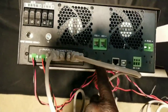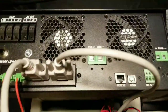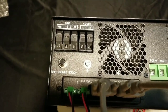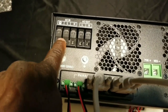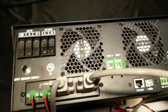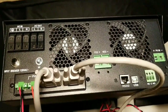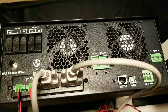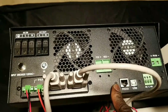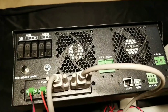Here is the battery terminal — it's recommended to use a four-gauge wire. Right there is positive, negative. Right there is the AC input from the grid — here you can give it the capability to charge your batteries. This PIP cannot sell excess power back to the grid — it's not designed for that. This one is built as a built-in inverter charger and a charge controller.